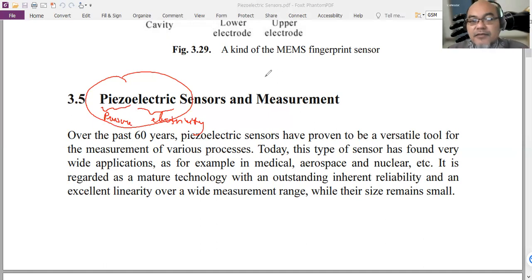That is why the piezoelectric material itself can also be used as an actuator, a piezoelectric actuator, in some high precision, nanometer scale actuators. They also use piezoelectric material as the transducer. Usually as a sensor, it will detect the amount of force or stress being exerted onto its two ends, and this force will polarize.